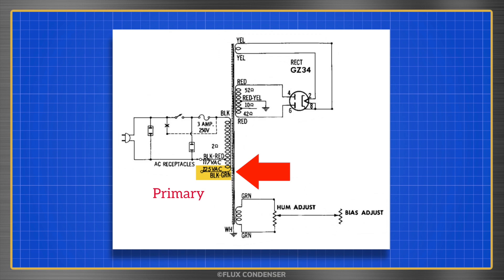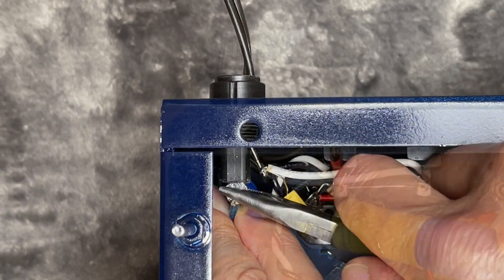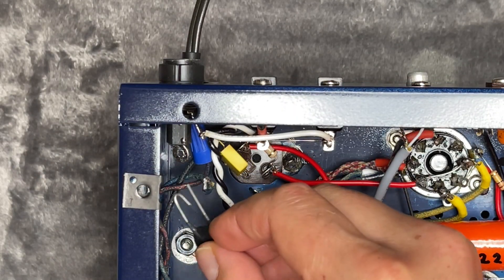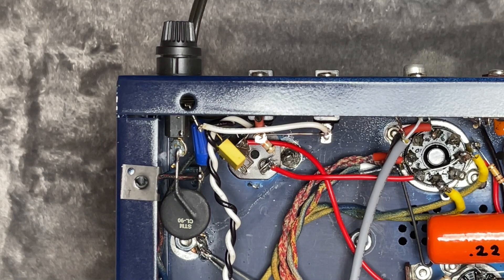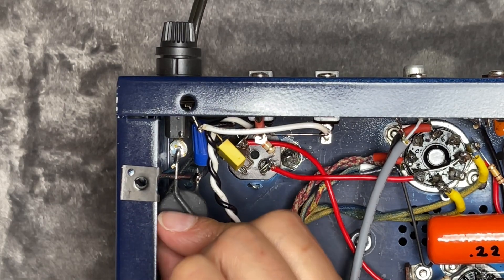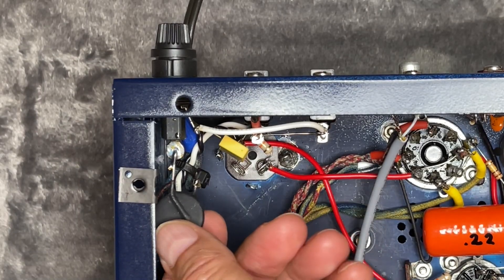I asked myself how I could make even more work for myself, and I realized that adding a thermistor would do the trick. So I undid the connection from the primary to the fuse and slipped one in. Putting a thermistor here really will be a good idea, as it'll give the amp a softer start and that'll be much gentler on the rectifier too. I've got a video about thermistors — please see my other video, Restored Antique Radio: Will It Work? Link in the description. Using a fuse holder as a terminal strip can be problematic, as the spring-loaded prong tends to move around. So I secured the wires with a zip tie to stop any movement, and that worked just fine.